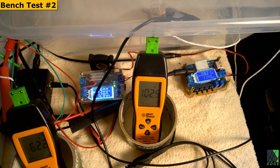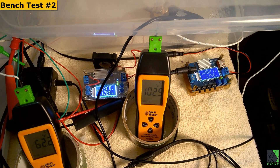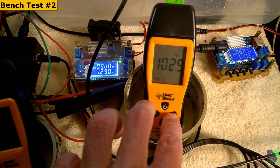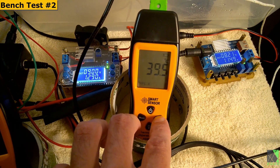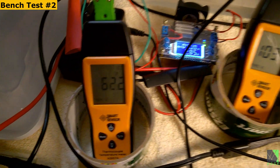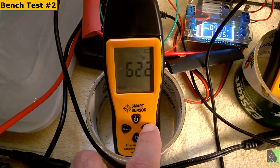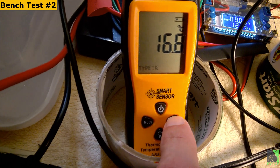You can see that it's 102.9 degrees. 102.9 degrees Fahrenheit is really not that hot because outside it's nearly 100 degrees. However, you can tell the water is really warm — for the Celsius folks the water is 39.4 to 39.5 degrees C. Now the air coming out of the air conditioner is 62.2 degrees Fahrenheit, and I've only been running this for a while. Celsius is 16.8 degrees on the outlet air.